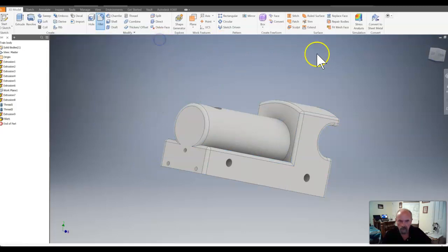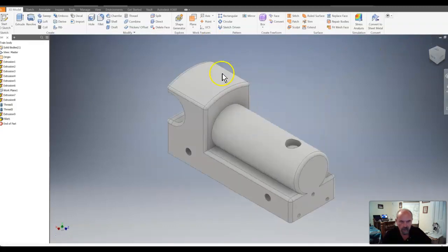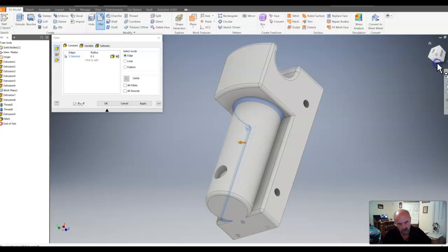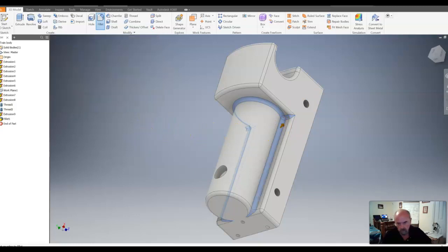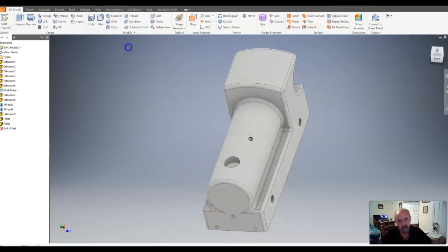Now, I also want to show you at this particular point in time. Okay, that knocked the outside edge off, but you can also do an inside fillet to make two edges rounder for an inside radius. So the fillet can work in the opposite direction as well. And that relieves the stress from fracturing on parts for strength purposes as well.